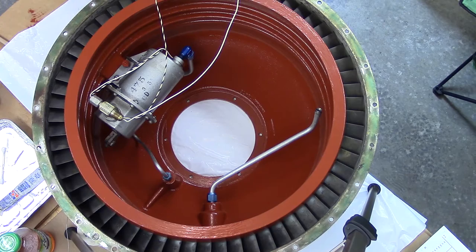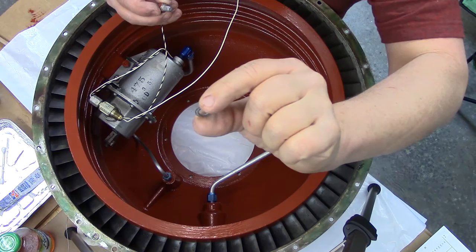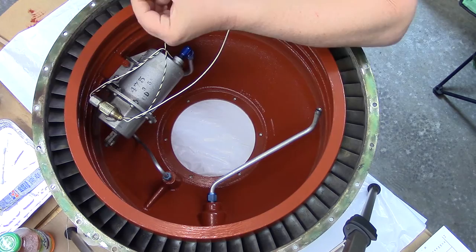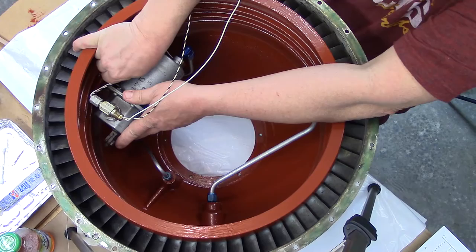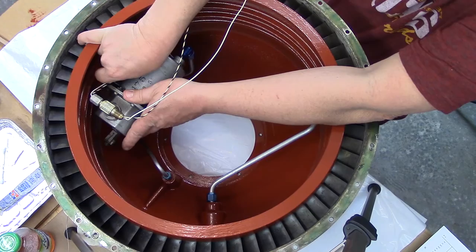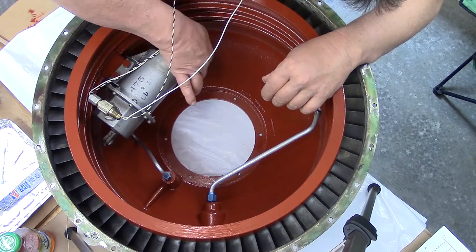AN — Army, Navy — I don't know what they call them. It's a really thin flat washer that fits right under the head of this screw. These screws will have to be lock-wired once everything's torqued. They have holes drilled through the heads in order to lock-wire and secure — they secure to each other so they don't unscrew. They're pretty well threaded down in there, still allowing this to move a little if we need to. Get these down to where they're almost just finger-snug — still can give a little bit.